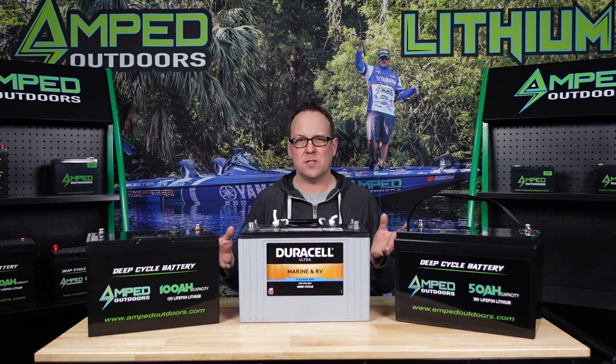We're going to have a couple of different links underneath this video that will also help you determine the right battery for your needs. We also have a graph in there — we took a 36-volt trolling motor, put it on a very common Ranger boat, used 100 amp hour batteries on a 36-volt system, and calculated amp draw. These were in real calm conditions, so it gives you an estimate of what your trolling motor may draw at different speeds, though every boat is going to be slightly different.